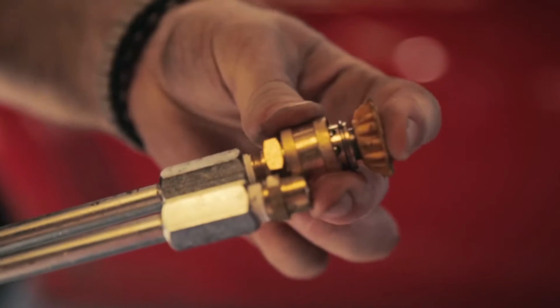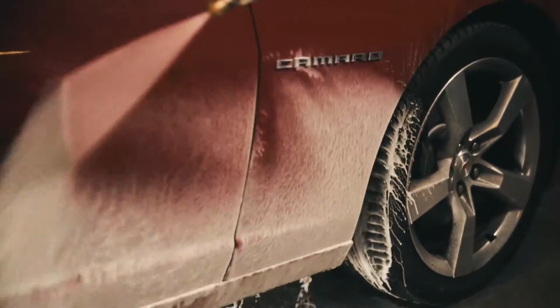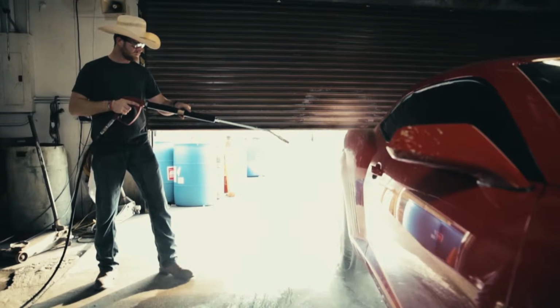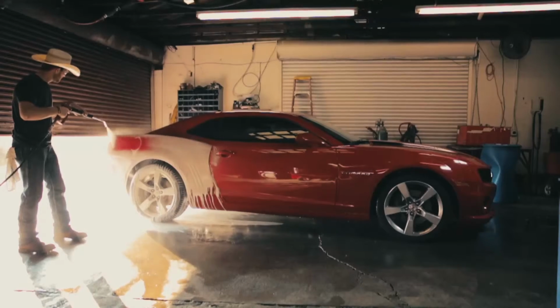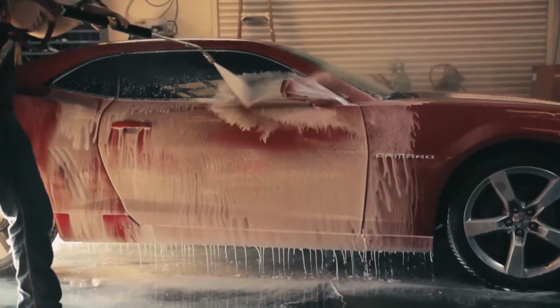surface. When washing, apply your soap solution starting at the bottom, pushing the soap up with overlapping strokes, while holding the wand's nozzle 12 to 14 inches from the washing surface. By working from the bottom up, this keeps the surface from streaking, which can ruin finished results.